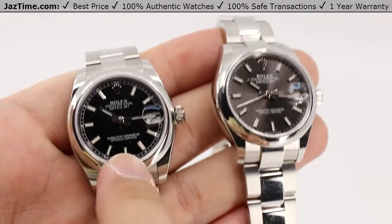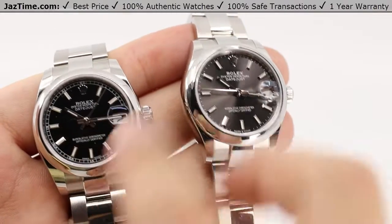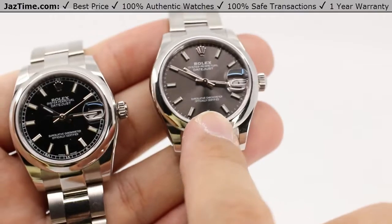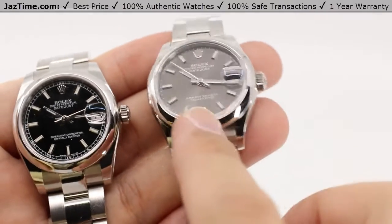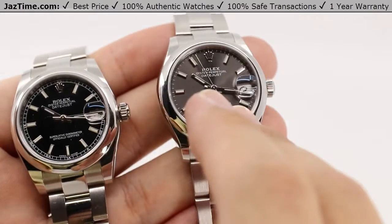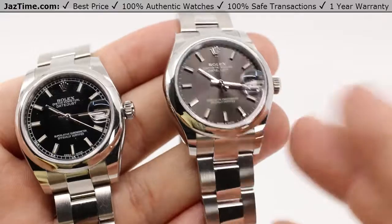The hairspring for the 2235 is an older Parachrom hairspring. While it's still exceptionally accurate, the 2236 has a newer generation hairspring called the Syloxi, otherwise known as silicon, which is known for its longevity and resistance to electromagnetic and temperature fluctuations, so you know that your balance wheel is in good hands, or spring, whatever.